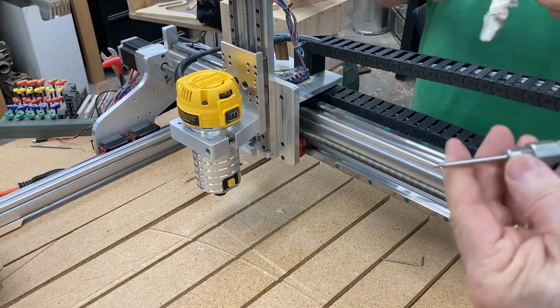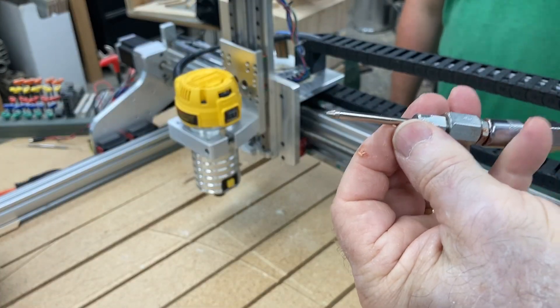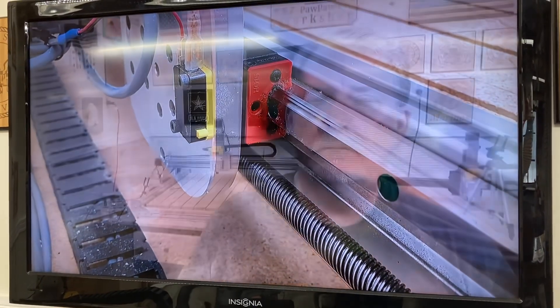Now let's get on to greasing the machine. I'm not going to go into tons of detail because I have very detailed part one and part two videos that show exactly how to do this. Here's an excerpt from that video. The Allen wrench I'm using is a two millimeter. I contacted the folks at CNC for Newbie and asked them exactly what grease to use, and what they recommended was the Valvoline Heavy Duty Crimson Grease. They also said if you can't find this, any heavy duty multi-purpose tacky grease would work. You're going to need a very long needle point to put the grease into that opening, and this attaches to the end of the hose on the grease gun. I'll put a link to that in the description below.